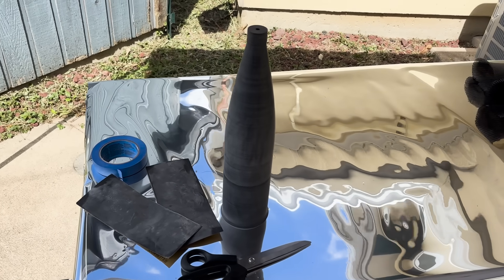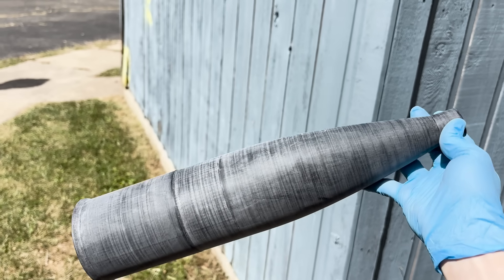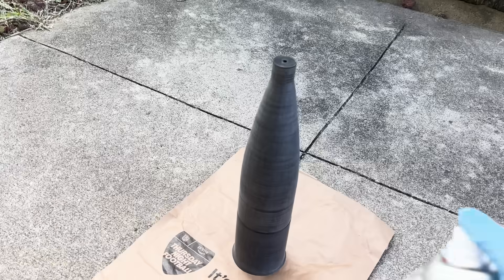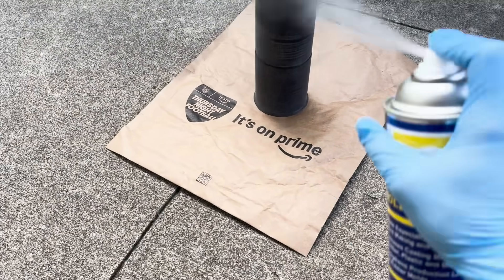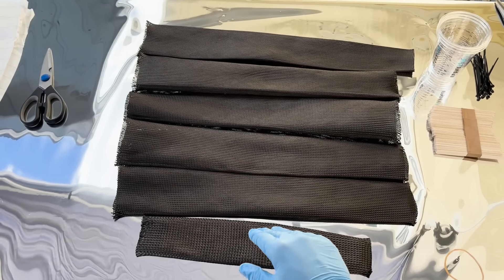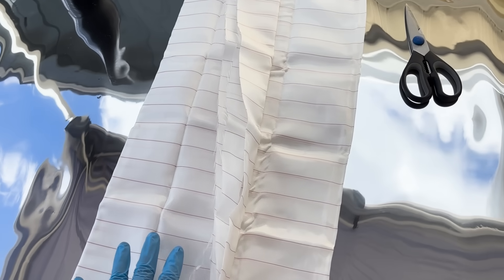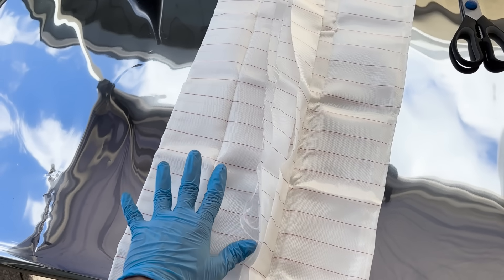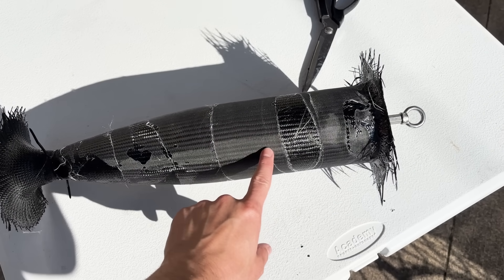For plan one, I chose PLA for the mold material because it has the lowest melting point of any filament I have. I prepped the nose cone layup and applied a tiny bit of spray-on mold release to the mold. I then added six sleeves of wetted carbon fiber and let the part cure. I also tried wrapping peel ply around the circumference to add manual compression — this did not work at all, which is why there's a weird spiraling pattern. I would not suggest trying this.